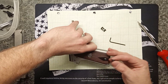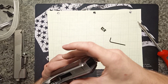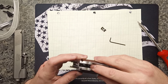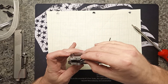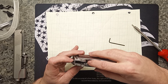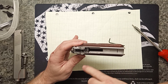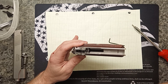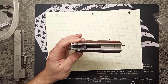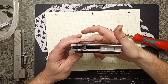The sear release comes in from the bottom, and I like to drop it in from the top. It pretty much always lands right where it should be. Make sure those two tabs on the sear are on top of the single tab of the sear release. You can also see how the back of the trigger bow right there is pushing on that larger tab of the sear release.